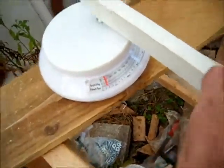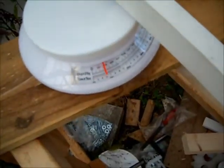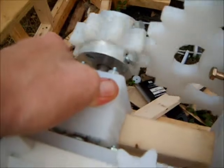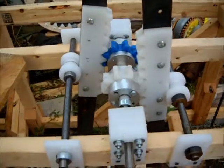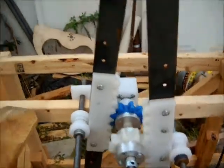So at this time this is kind of difficult to do, but I'll try it — slowly increasing the tension on the prony brake. You get an increase... I think it shifted. There it is. I haven't secured this yet. You get a reading at the output of about a pound. And if you can calculate whatever RPM that is, that'll show the approximate horsepower. You can tell how putting a load on it severely limits the travel, and it increases the RPM at the orbiting weight.